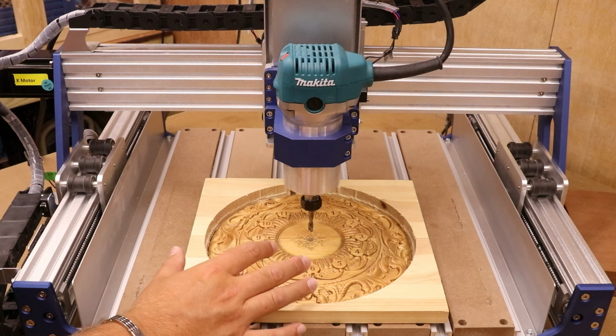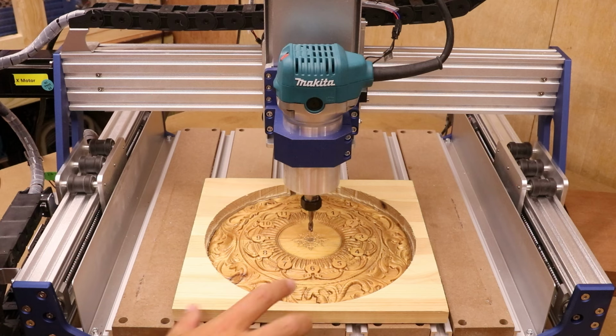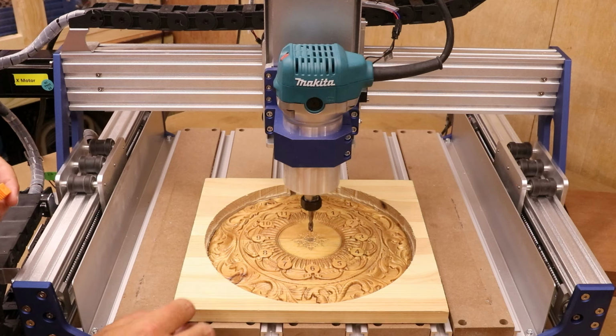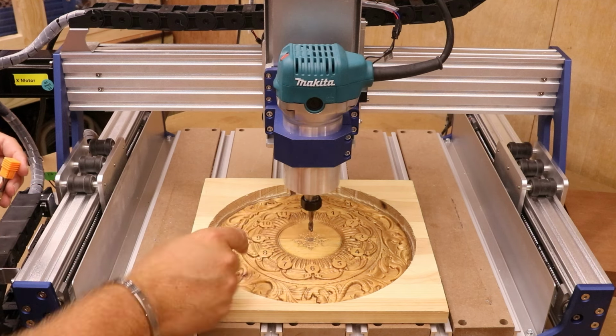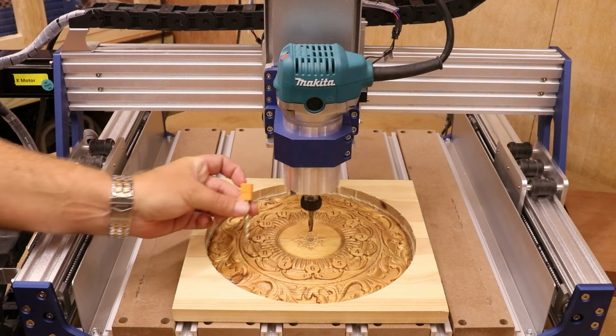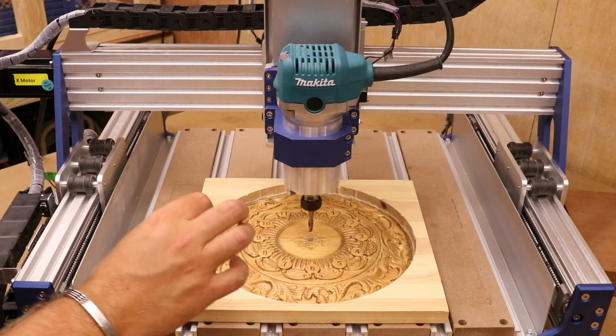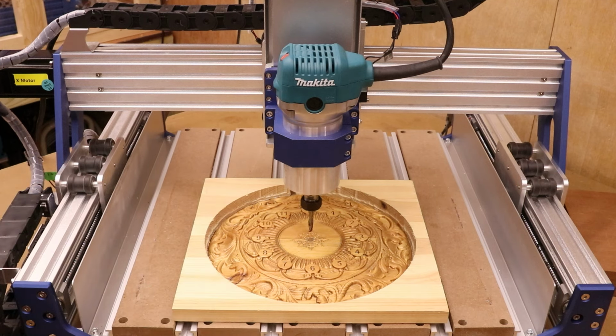If you are doing a job like this, where you've got a bit of blank space around the outside, even if there are clamps in position, set the Z height somewhere that is not going to be machined. So in this scenario, for example, I would set the Z height maybe in this corner, do the first passing with the roughing bit, then when I came to drop the tapered ball nose in, I would set it from that exact same spot as well, just to guarantee that it was consistent in the height that it was set from.